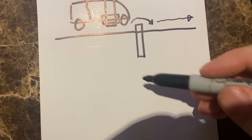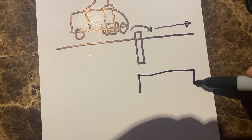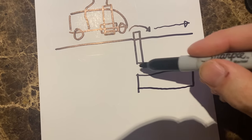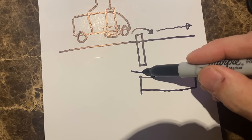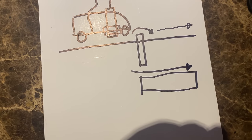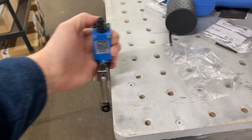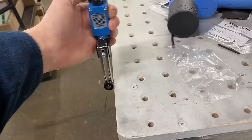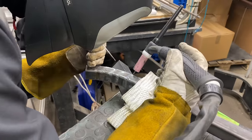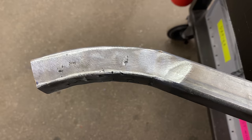It needs to be latching and really reliable to stop. So instead I'm using a much longer bar and an end switch — the longer bar reaches it and the train knows it's still on the end stop, so it can slowly decelerate and stay on there. The inductive end stops had a clearance of two millimeters: more than two millimeters and they wouldn't register; less than two millimeters and the train would just crash into the end stop rail.